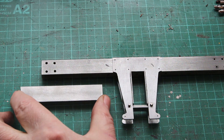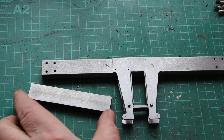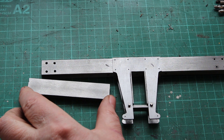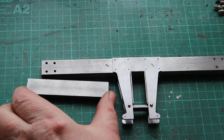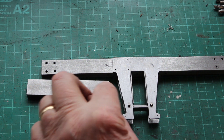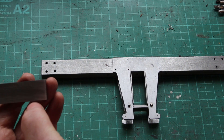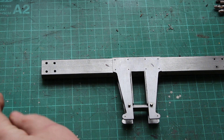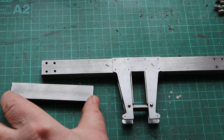So, I've got a bit of bar here. This is actually an off-cut from making this frame — what's left of this particular frame — so I can get two of these brackets out of here. The first job is to cut this on the band saw. I think probably the bracket on the original engine is actually a U shape rather than a right angle shape, so that's what I'm going to do in this particular case.